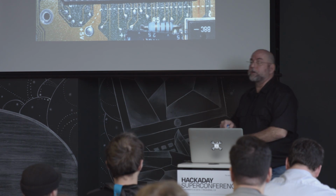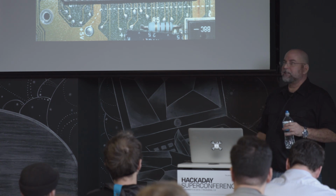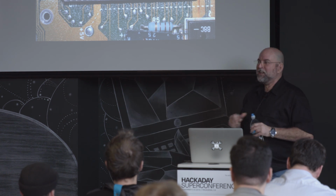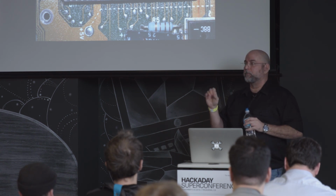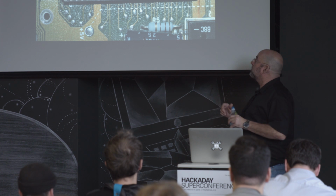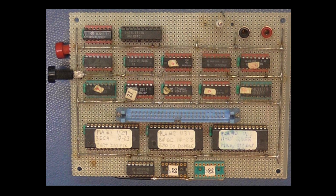And we had this PLA. It turns out, years later, I find out they had too much boron in the silicon nitride passivation. Now, that sounds boring, but if you hung around chip guys, you'd all be like, oh, boron, oh, that's it? Because it would get this purple creeping crud. It'd get infected with moisture, and you could actually look under the microscope and watch a Commodore chip eat itself. But I needed one, so hopefully we had fixed enough of it. And the PLA was born. And of course, we have to emulate it. So we've got multiple other PLAs trying to string them all together to make the 140 pin.